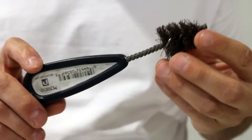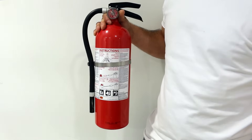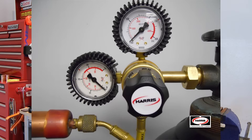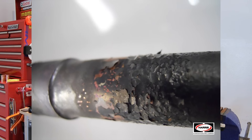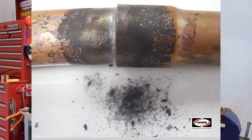Some other items I'll mention in the video are wire brushes, an inspection mirror, and a fire extinguisher. If you're brazing on a refrigeration or cooling system with costly components, it's highly recommended to purge your lines with an inert gas such as argon or nitrogen. During brazing, a lot of oxidation occurs inside the pipe, creating scale that could potentially clog costly components and even void a warranty.